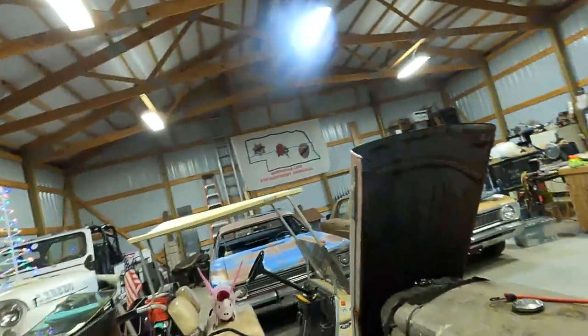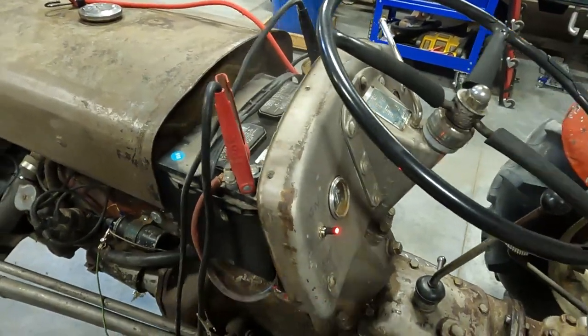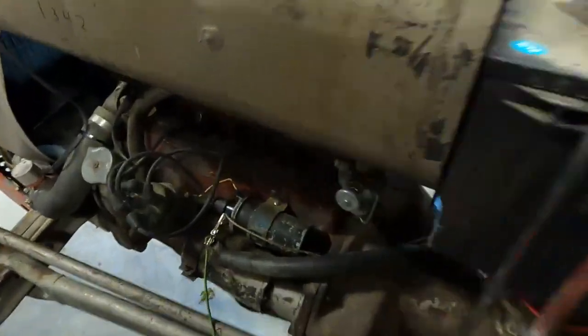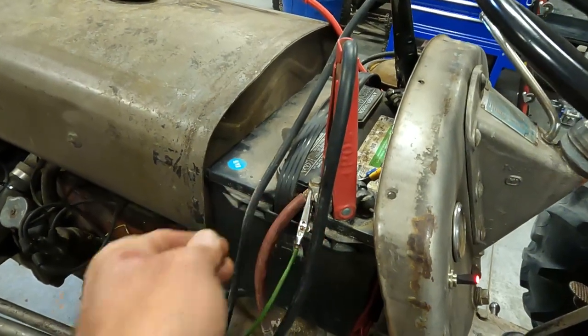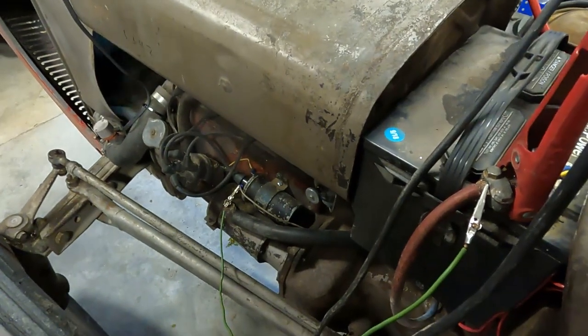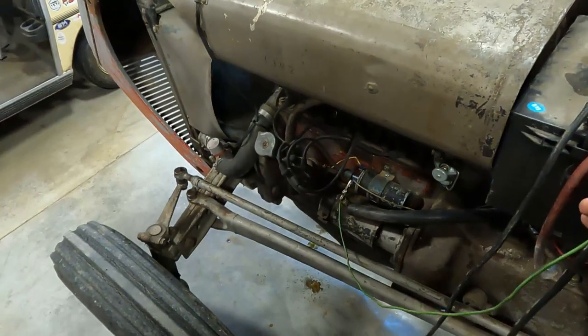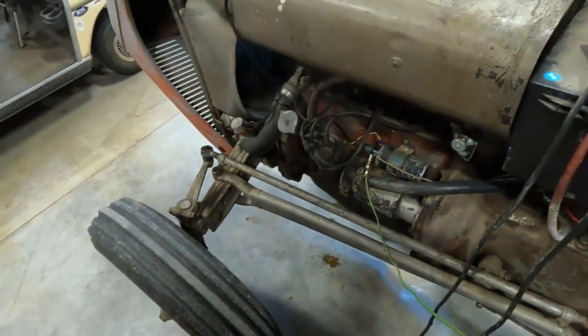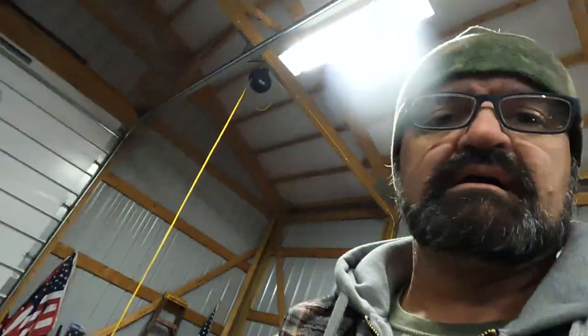So here we go, same scenario. Ignition on, idle, everything's the same, except we're going to have a jumper wire from the positive side of our coil, and we're going to give that 12 volts right here. And give it a little spark because we're giving her a little bit of boost. Now, let's try starting it. And we release. Are you kidding me?